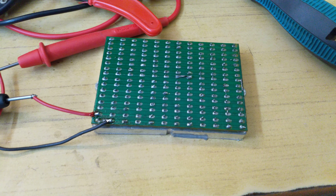This is an SMPS-style power supply — I have 12 volts coming in and I can smell some burning. This is a 5 volt, 3 amp switch mode power supply. I have a more complex 4 amp one kept inside, but if I run the 4 amp one I'll get 4.5 amps here, just like I was already exceeding 3 amps.